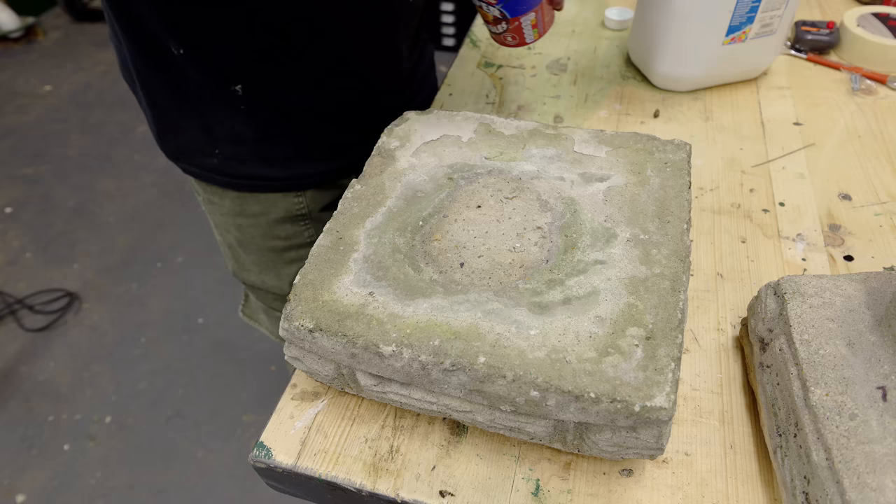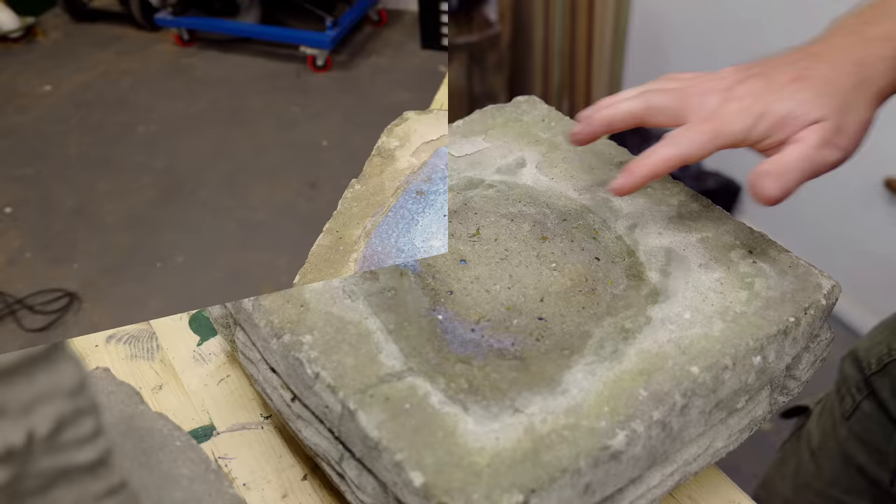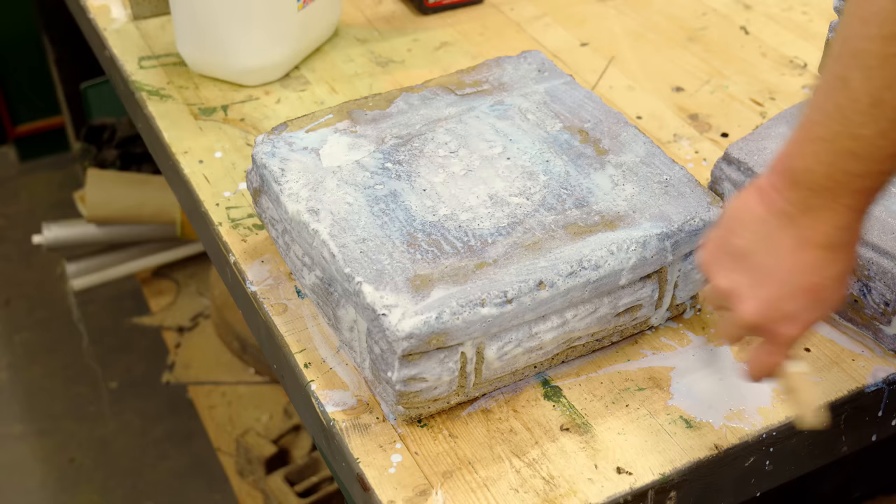This is just an experiment so I'm just going to apply a little to the underside and once that's dry we'll see how it's looking. This is a synthetic resin-based primer normally used for treating gypsum surfaces before installing tiles, but it can also be used on cementitious surfaces before painting. It seemed to do a great job at sealing up the concrete so I applied it all over except for the bowl of the bath itself.